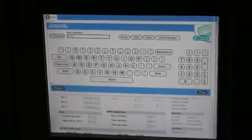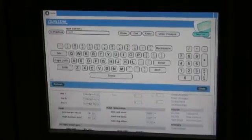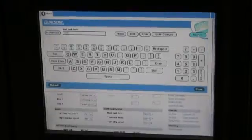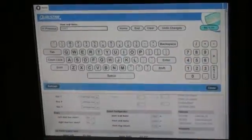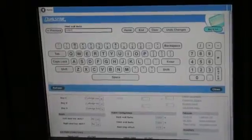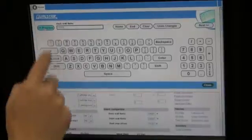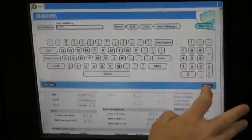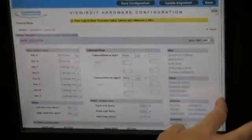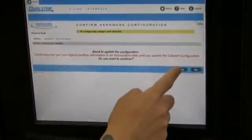To generate the back wall theta value, we need to add the right side and the left side T position numbers and divide that final number by two. That number will generate our back wall. Once we have that back wall number generated, we need to input it, select next, and go to the front wall theta. If your ending number is a 15,000 number, your front wall is going to be 33,000. Hit close, scroll down, and select update alignment, then select yes.